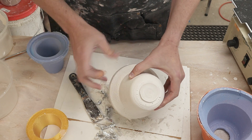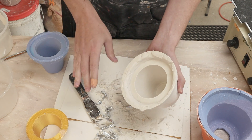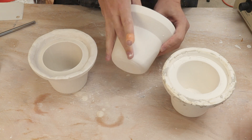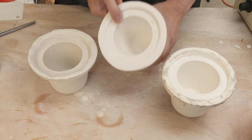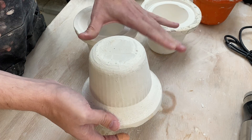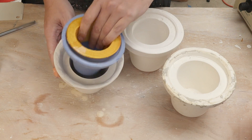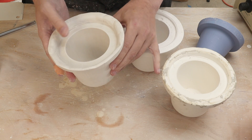Part of this may be because I forgot to put the Windex on before I assembled the mold. But either way, since the bubbles are coming this way I don't have to worry about them — this is the part that gets cast against. Here is where I've gotten with my fight against bubbles. I started with a bunch of bubbles on the outside, but unfortunately I had bubbles on the inside as well. By changing my technique I was able to get rid of all the bubbles on the outside — unfortunately that's the side that doesn't matter — and I wound up with bubbles on all the top surfaces, so they all floated up but still got captured. By casting things upside down, all the bubbles floated to the outside surface which has some problems, but the inside surface is actually much much better. All the part that is the shape of the pot is more or less perfect, and I think by being more careful with my Windex I might be able to get rid of any remaining tiny pinhole bubbles. Overall this seems like a large improvement.